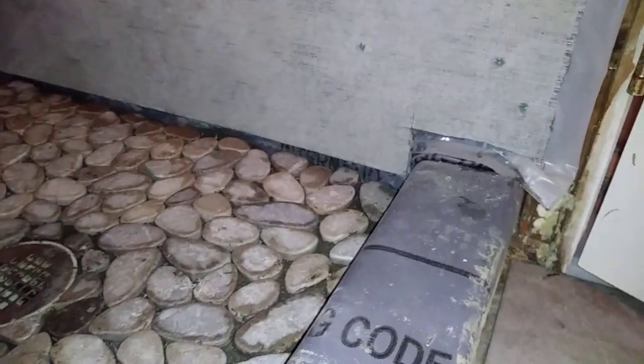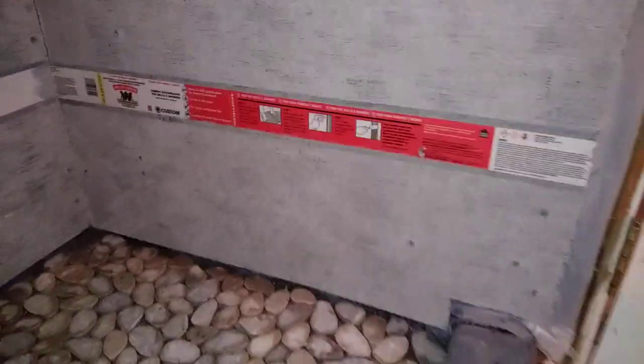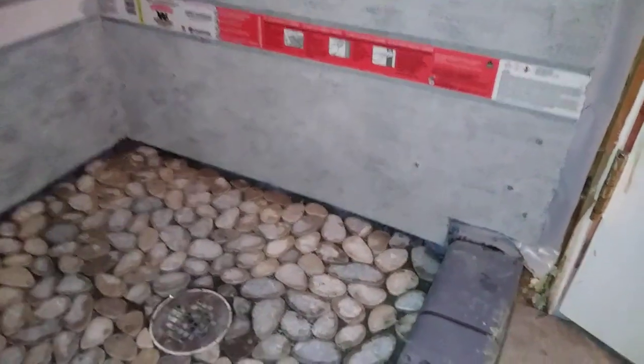Some guys go a half inch, some go an inch. I go according to what kind of tile I have. I have better than 8-inch tile going in here, okay? But I like to maintain about an inch, okay? You can see the wet bed underneath of it, the liner. All right, it's all designed to capture moisture. It's all designed to keep that from rotting.